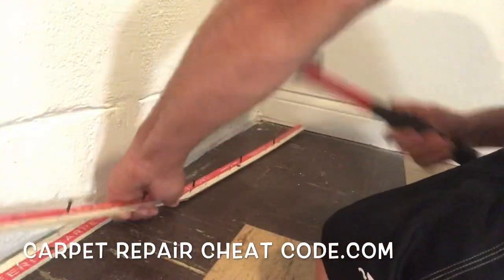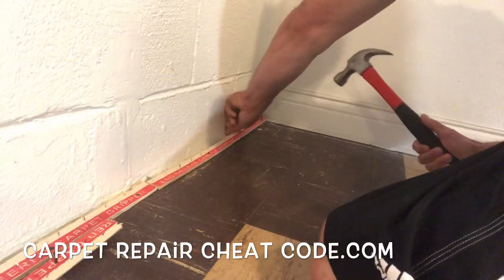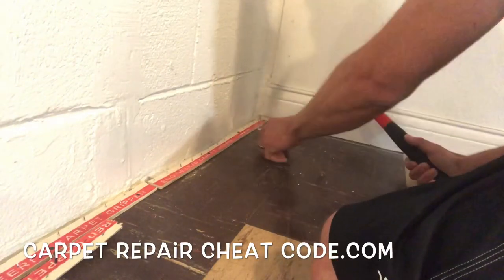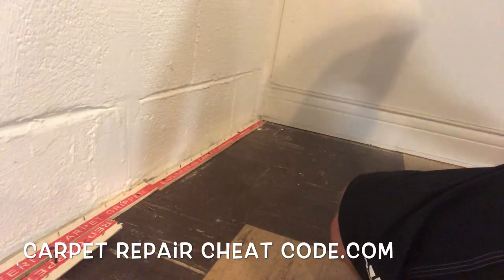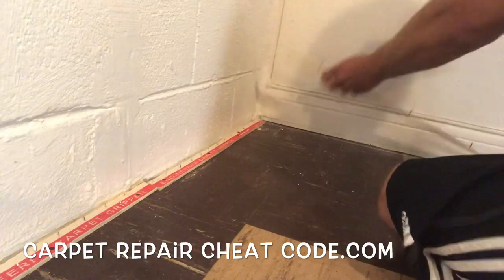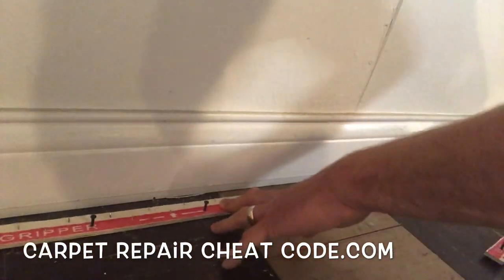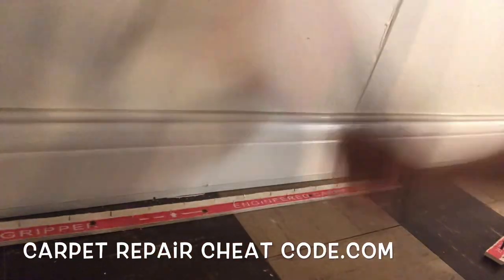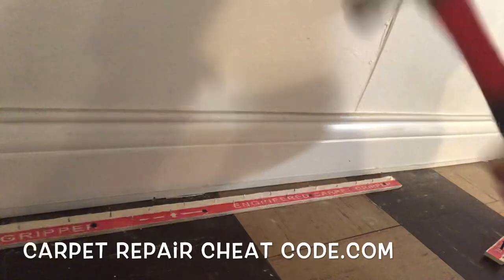No tin snips needed — just smack the tack strip with a hammer where you want to break it and nail it down. If you run short on nails, pull one out, smack it down, and reuse it where you're missing one. We MacGyver everything in this game — it's the most basic industry out there. A couple of simple tools and you could make mad bank. Just be careful next to the baseboards; that's where DIY and newbie types smash and break them. And that's all for this one.